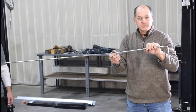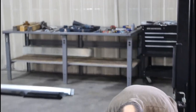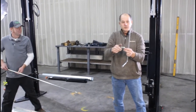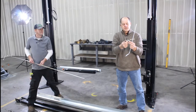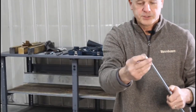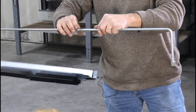The compression fitting comes pre-spun onto the piece that connects to the pump — people sometimes call thinking it's missing, but it's right there. The compression ferrule is inside the nut. After cutting the line, slide the nut on and tighten it onto the fitting. When tightening, have someone stand on both ends to keep the two drop legs parallel — you don't want them crooked.